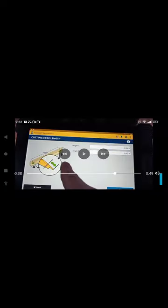Remember which side is A and which is B. Then tap where it says .44 — that's 44 hundredths — let it light up, tap it again, and it'll put the cursor to the right of the last digit. Hit backspace once and change it. I probably wore about two or three hundredths off the day before, so I ended up putting it to 41 on one side and 39 on the other. You have to do this every day — or at least make it a habit. When you neglect it, your cutting edge wears down and your grade gets higher and higher. You can forget to do it and wear two tenths off your cutting edge in seven days, and then your grade is two tenths high because the machine isn't compensating. It's super important to check your blade wear every day.